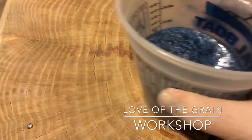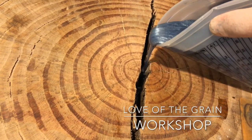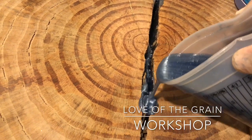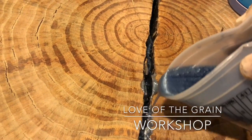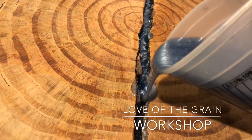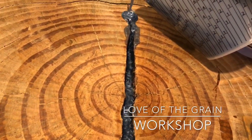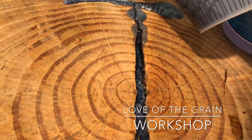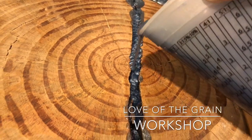You can see it's already bubbling and creating gases from the heat, so we're going to go ahead and pour it. A nice feature of these cups is that you can pinch them pretty close together for a controlled pour. On the bottom side we just have some tape covering all the cracks so it doesn't leak out. It doesn't always work though — this stuff is pretty viscous and goes everywhere, so you've got to make sure you have a really good seal underneath that tape.